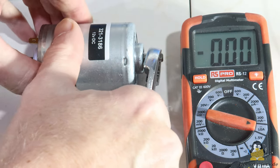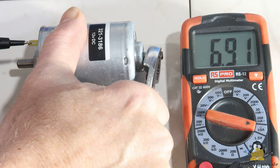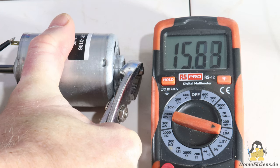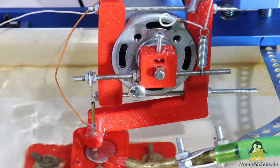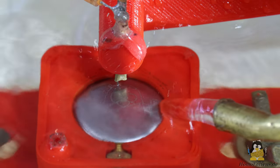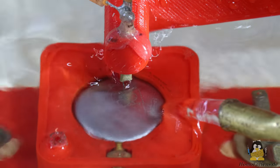The third engine in my test series is also the most powerful. This draws a current of 2.7 amps at 3.3 volts, 7.2 amps at 5 volts, and a scary 15 amps at 12 volts. I do the first engraving with 3.3 volts. After the engraving started, you can see that the sparking is not too powerful. Nevertheless, the DC motor works reliably as a Wagner hammer even with the lowest voltage my computer power supply delivers.